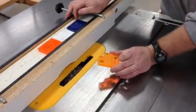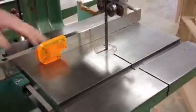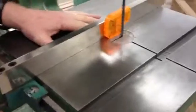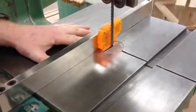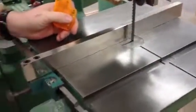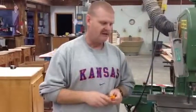Interesting — that's a good thought. One other thing I use it for is on the bandsaw, and this is a really neat application. Since bandsaw fences are — a lot of them are metal — this is such a neat application because you can snap that right to the fence. You don't have to worry about that moving. You can slide that up there and bump it right up next to your blade. For resawing applications, just slide that out and you're ready to do your resaw. A lot of resaw applications you're going to sand down to the line with a surface sander anyway, so you're not trying to be real accurate. This makes it so nice for the bandsaw. I've used this a lot too.